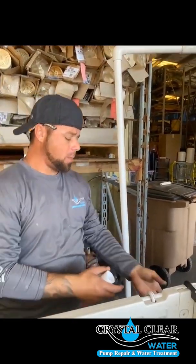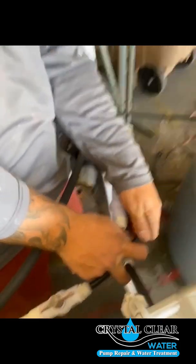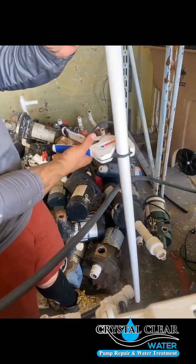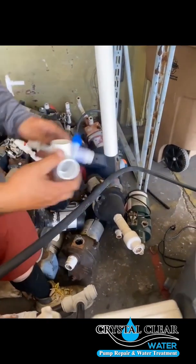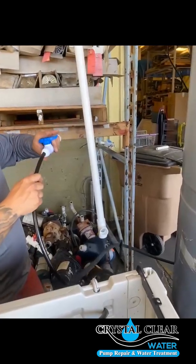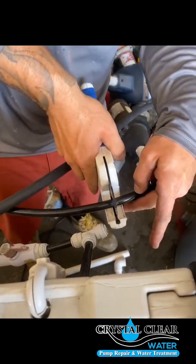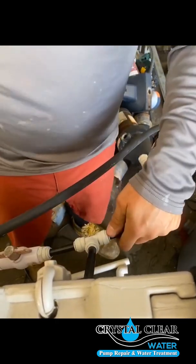Pull them straight down to your backwash tube. Disconnect what's existing and take this piece out — they're just compression fittings, so push down and pull and the piece comes out. Cut in to your pipe, clean and glue the T in. Take another piece of backwash tubing, plug it into the backwash port, glue it in, cut down, and plug back in until you feel it pop.